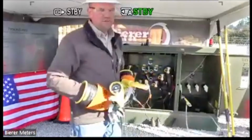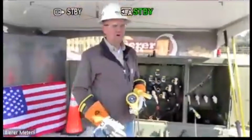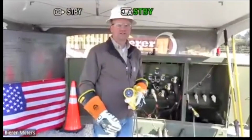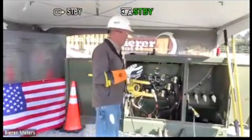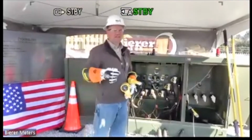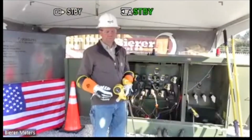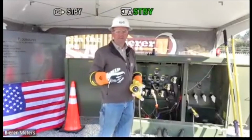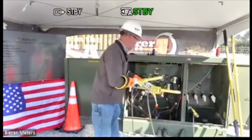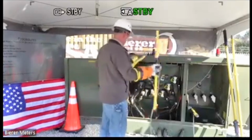And I want to do this in the 2 kV switch position. Depending on the manufacturer, capacitive test points can have anywhere from 200 to 300 volts roughly. Again, if it's failing, obviously less than that, but all the manufacturers are different, even the same manufacturer, and if they're different ages, could vary substantially. So in the 2 kV switch position, it's going to give me the accuracy in order to phase and test the capacitive test points themselves.